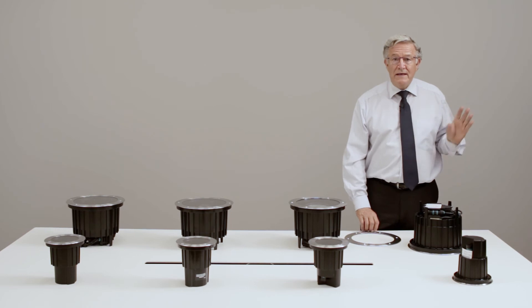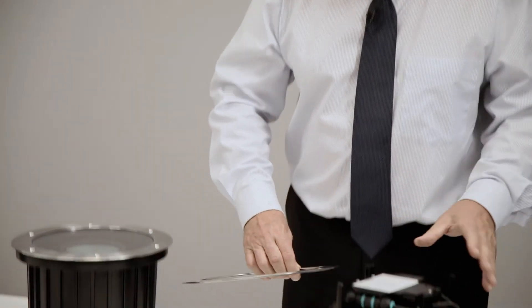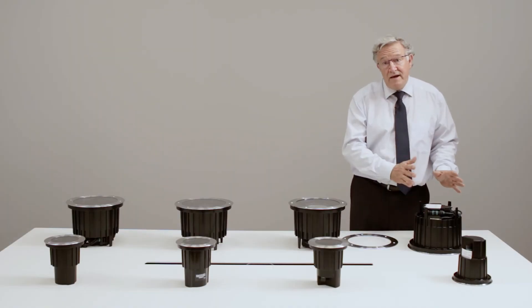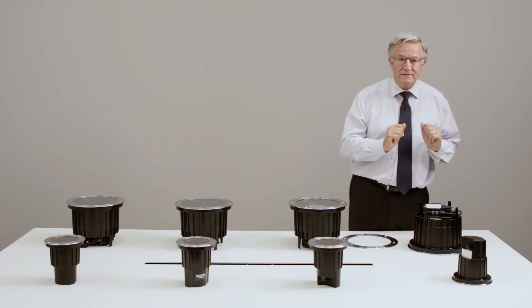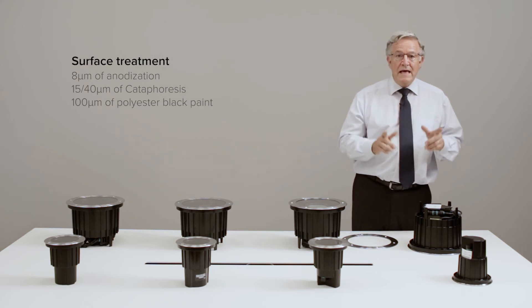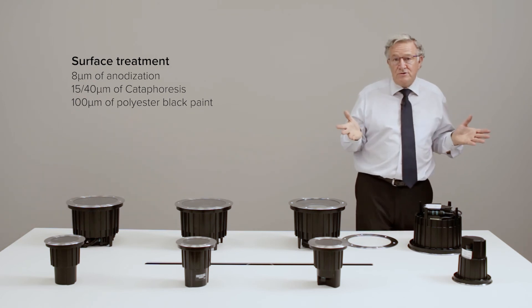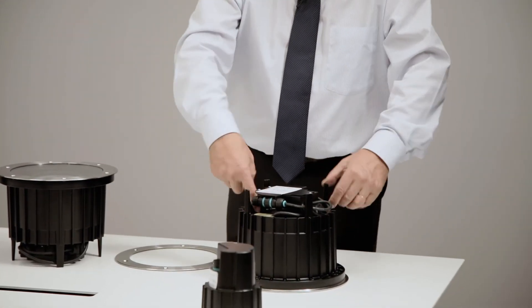The entire Keplero family has rings made of stainless steel AISI 316. The bodies are made with a new aluminum primary alloy with very low copper content, which greatly increases corrosion resistance. On top of that, they are treated with 8 microns of anodization and 15 to 40 microns of cataphoresis — an electrocoating that grants protection to the entire exposed surface, even the most hidden areas.